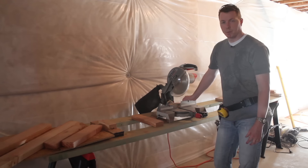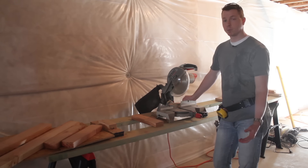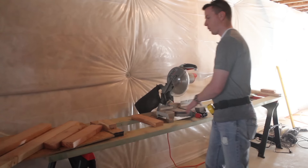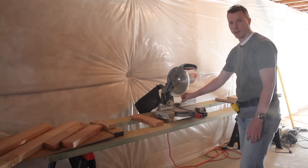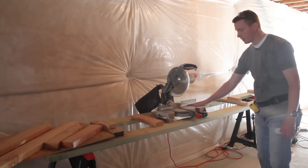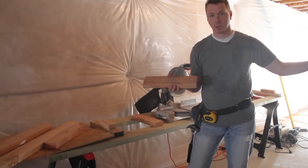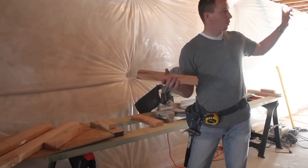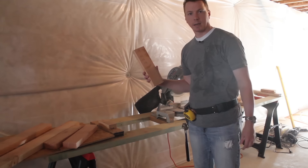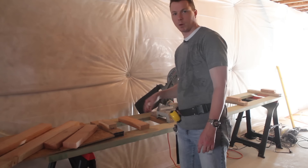Depending on your situation, if you're just going to be framing one room, it might not make sense to set up a whole workstation like this for your chop saw. If you're going to be doing several rooms or a whole floor or basement, it definitely makes sense to get some stations set up so you can use your workhorses. I've got my saw fastened down to these 2x6 green plates, and I've also got stoppers raised up so I have a nice flat surface to lay down my boards. I've also got extra pieces from my other rooms that will be big enough for some of these little cross-members. It's nice to write measurements on pieces of wood so you don't have to try to remember anything — always better to measure twice and cut once.